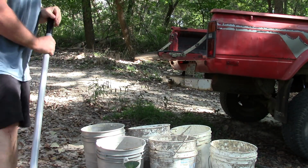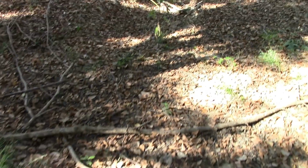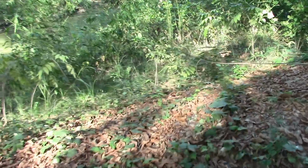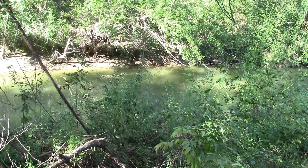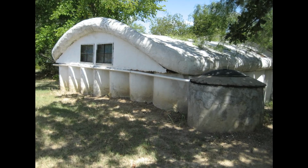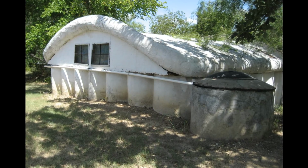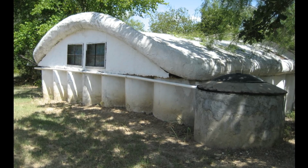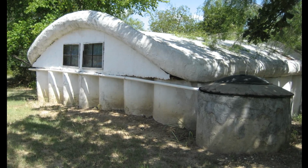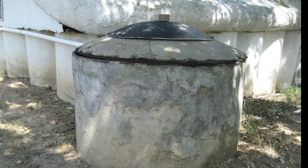And both the cases I know of where people use this sand to do ferrocement work, the ferrocement has failed. So let's just look at those cases real quick before we go into messing around with washing sand. The first case I want to look at is this cistern that fills from this garage on the side. So I actually helped build this cistern. Bob, who has passed on, we did this one with creek sand.